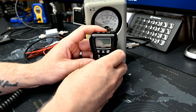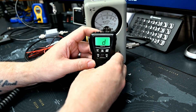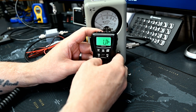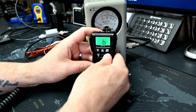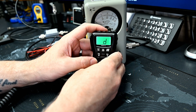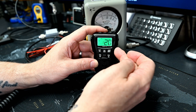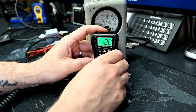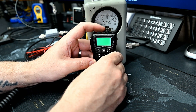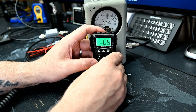Now that the radio is expanded, let's see what's changed. When you hold AF and the power button to turn it on, it no longer shows norms — instead you have band blocks from A through to UK at the end. The radio will default to block D. In normal operation, there's no quick way to switch band blocks; if you go past channel 40 it just wraps back to channel one in block D. To switch blocks you have to turn the radio off, hold the two buttons, and then change the band block — a bit of a nuisance.